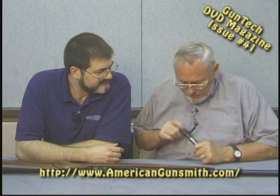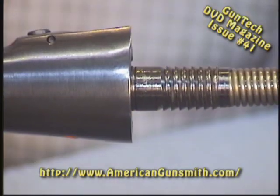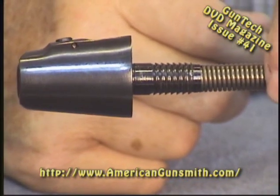It has a safety lug and if I remember right it touched — just barely, but it touched. The buttress threads on the bolt sleeve — I like that. Instead of being a V-thread, they come straight up and over, so you have a 90-degree shoulder, which is a stronger type of thread than a V-thread. I think the Germans came up with that in the Mauser 98.